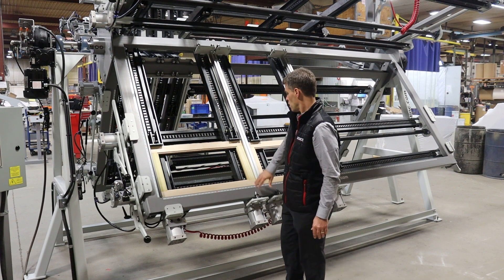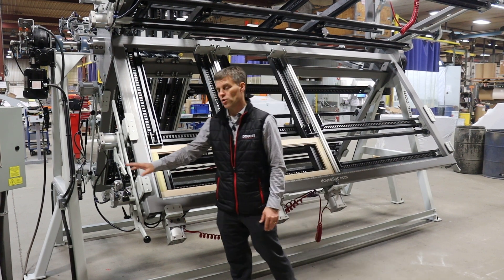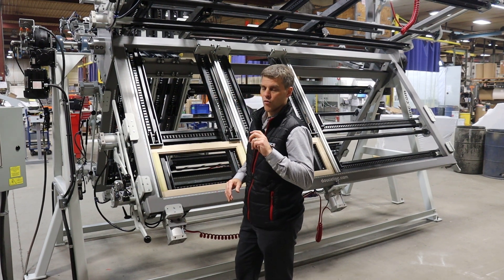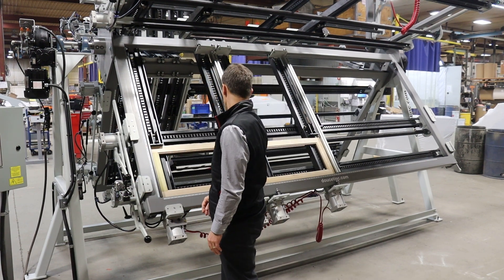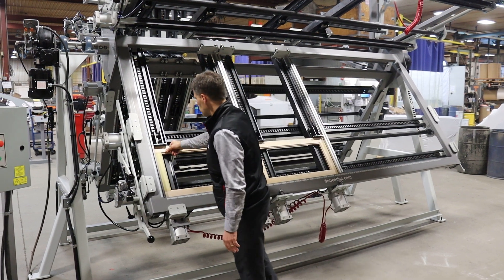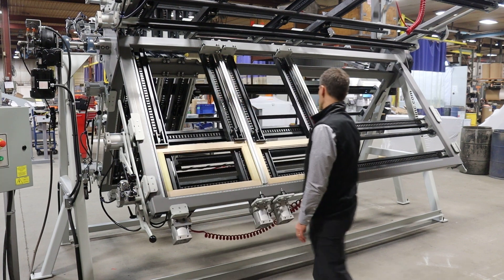Today I'm doing the 90-degree door, so I don't need to stop at the low pressure sequence. But if you are doing a 45-degree door with mortise and tenon joints, you can still do that in this model — you will be stopping at the middle position for pre-clamping. You can make a visual check on the joint, make sure they're looking good, and then you can apply your full pressure.